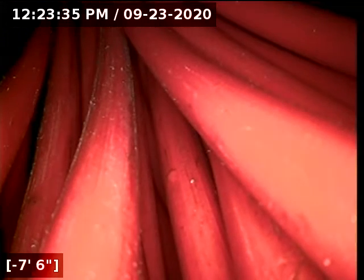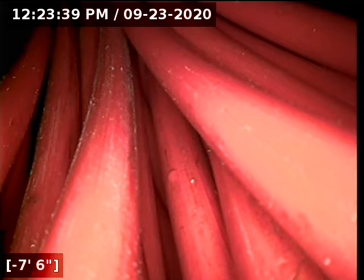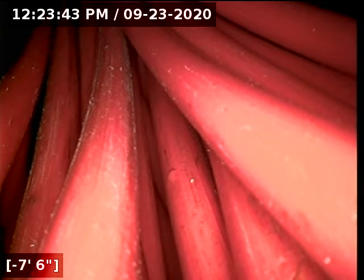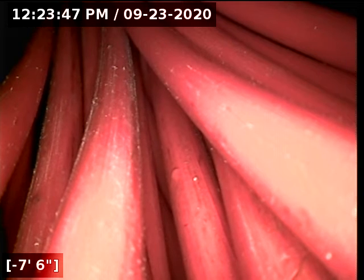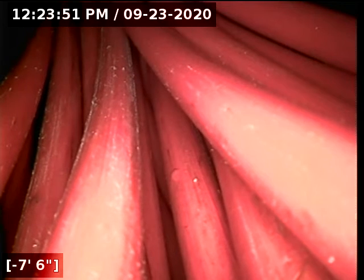And then you've got the other belly up near the entrance to the building. That one's the most significant of all of them because of its proximity to the building, and it's got almost 3 inches of standing water in it with no water running at all. So, would recommend spot repairs on all those. Again, line is functioning. We don't have any major buildup in the sewer line right now.